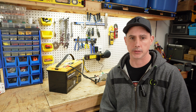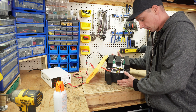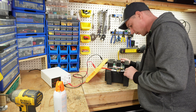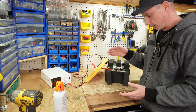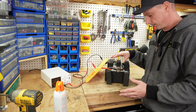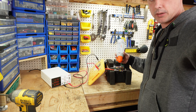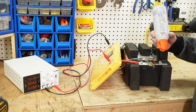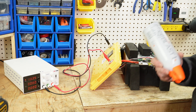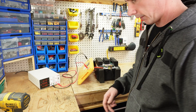Let's open it up and see the internals. I've got the pack out — we have pouch cells, which is fine; lithium iron phosphate pouch cells is fine. We have a BMS here. Checking the translate app, it's a 100-amp BMS, which is good. I want to do a cold temperature test — even though the cutoff is set to minus 10, I'll test it using a duster to get below minus 10 degrees Celsius to see if the BMS cuts charging. It did disconnect, but again we're disconnecting at minus 10, which is too low — lithium iron phosphate should be zero degrees.